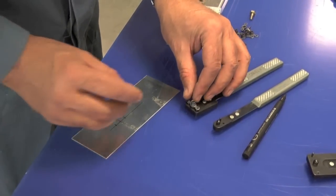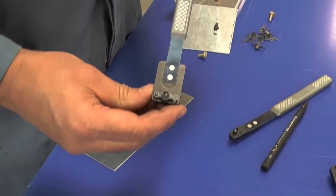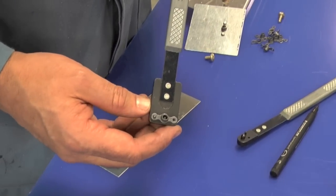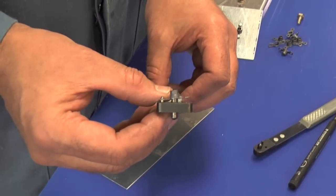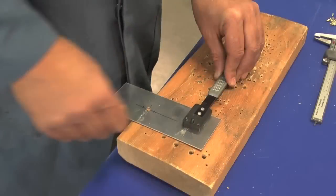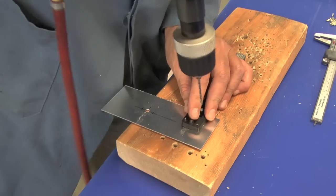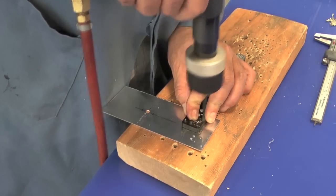Also confirm that the drill jig has the same spacing to the small pilot as found on the anchor nut. Note that the anchor nut is not expected to sit flush on the jig surface. Next, place the single large pilot into the fastener hole in the skin and drill a number 40 hole.